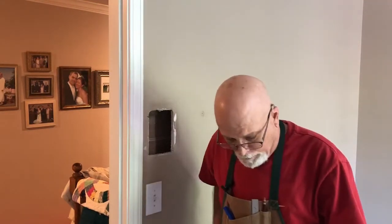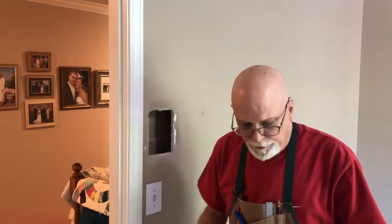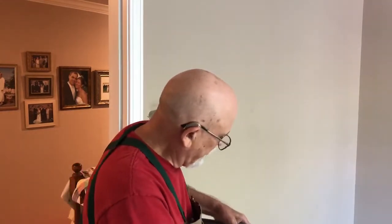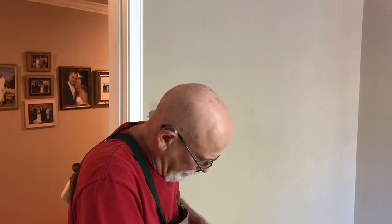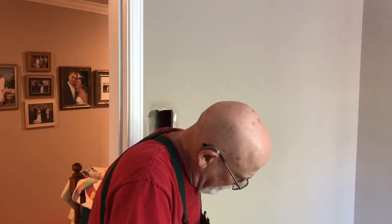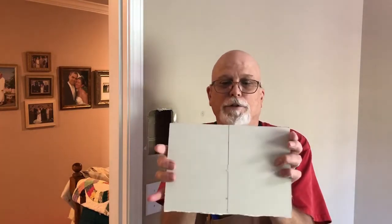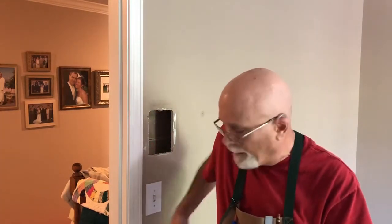Here, let me get my knife. All right, so you just take a knife, and I'm just taking a straight edge on this line, and I'm just going to score it. Usually you do that on a table or something, but I don't have one up here. All right, so all I've done is just score that line. I've just broken that first layer of paper. So now all you have to do is fold it like that, and then while it's folded, cut the other half of the paper, without cutting yourself. So now, that's all there is to cutting drywall.